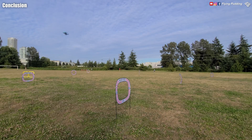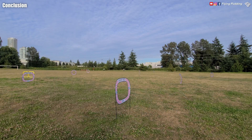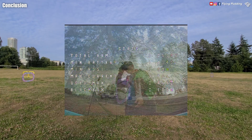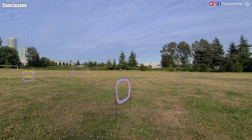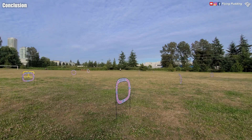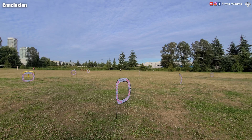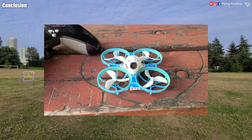Meteor 75 Pro Analog is an interesting offering in a simple package. The build is ultra clean with no soldering required, making it very easy to maintain. It is also incredibly durable. 5-plus minutes flight per pack allows plenty of time for practice and fun. The quad size works well for both indoor and outdoor, even with some wind and gust. Solid ELRS performance. Very quiet and discreet so unwanted attention is kept at minimum — parents or dog walkers don't scream at it. Still, analog video is mediocre and spotty when flying around trees and obstacles. With a 5V BEC at 3 amp max, upgrading to a digital VTX may be limited and tricky. Overall, it is a minimalist fly-anywhere machine for carefree flying that is built to last.